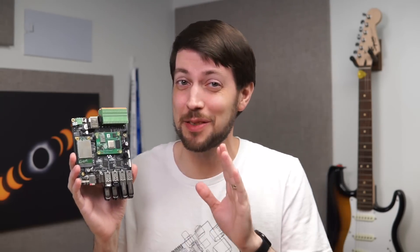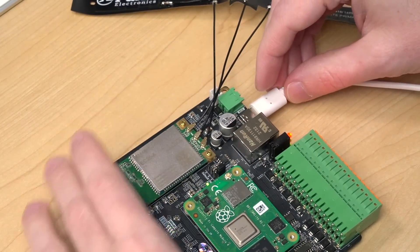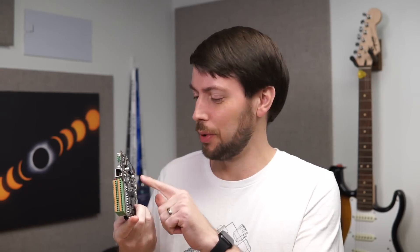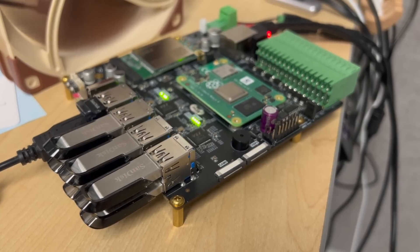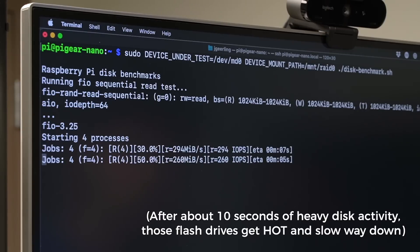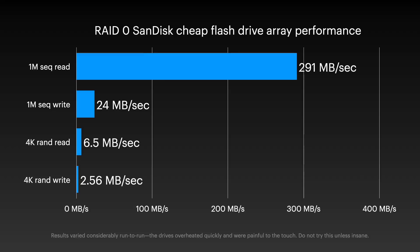Alright, so after doing all that and spending some time using it, I did find a few issues. First of all, you can't power up an infinite number of USB devices when you're running the board off USB-C power. You can hook up a better power adapter to the power terminals and supply anywhere between 7 to 30 volts of power. Also, for some reason, when I tried booting the system off the NVMe drive, I ran into about 90 seconds of delays until the system was up and running. I'm not sure why, but I did see a few errors during startup. I could use the system as usual after it booted though, so maybe it's my own fault. I also had a little fun playing a game of 'Will It RAID' with all eight of these USB flash drives. I put them in RAID 0 and ran some benchmarks. The crazy thing is, I could get almost 300 megabytes per second of sequential read performance across all these drives, but it kind of fell off a cliff for anything else. You can only write about 24 megabytes per second, or like 2 to 3 megabytes per second for small files. And that's using RAID 0, which is the best performing but really the most risky RAID level. Nobody ever said cheap flash drives in RAID were a good idea.